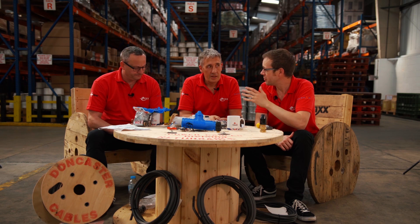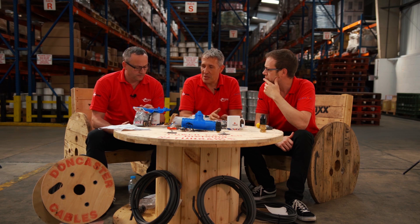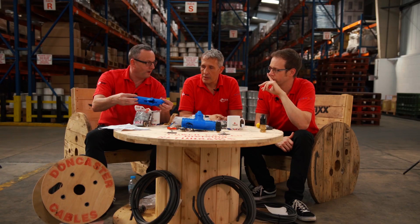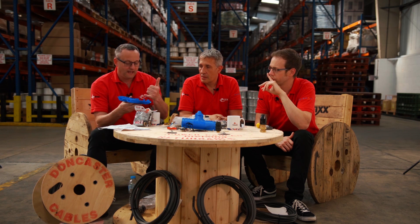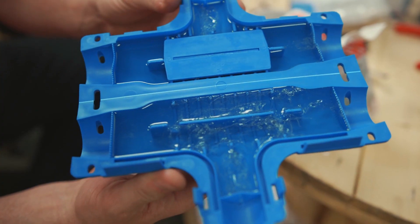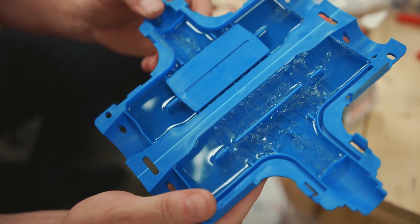The online information is a little bit ambiguous — there are multiple products in that range, some of which claim to be IP68, but this one doesn't seem to have any IP rating stated. And unlike some of the other products in the range, when the actual joint is inserted and closed, there's maybe no clamping at each side. Which means, for me personally, how is this steel-armoured cable secured apart from the length of the conductors being cut precisely to prevent pulling one way or the other?